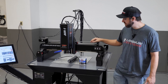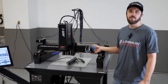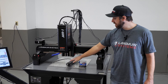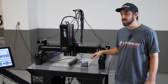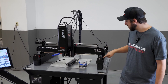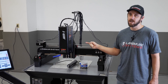You're going to need a couple of different items. First, you're going to need a tub of lithium-based grease — you can get it at basically any auto parts store. Brand's not really important, just make sure it's lithium-based grease. You're also going to need a grease gun to shoot grease through Zerk fittings into the linear bearings. You'll need a six millimeter Zerk fitting for the X-axis and Y-axis linear bearings, and a four millimeter Zerk fitting for the Z-axis linear bearings.